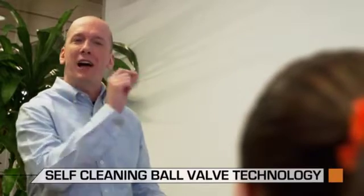It does all sorts of awesome things. Dad says it can even clean itself — I've tried to get my room to clean itself, but it never works. How could it do that? Well, Bella, the Belimo Zone Tight Valve is more than your standard zone valve. Instead of a paddle or short stroke plug, the Zone Tight uses self-cleaning ball valve technology.